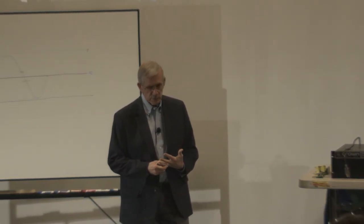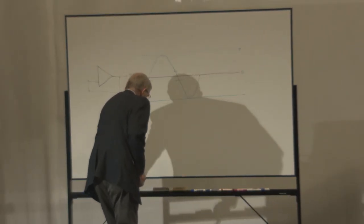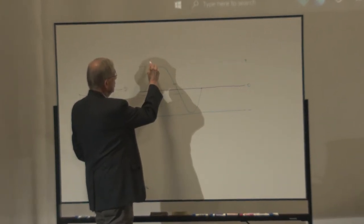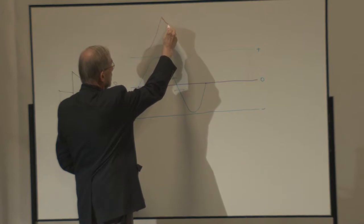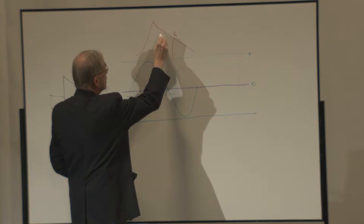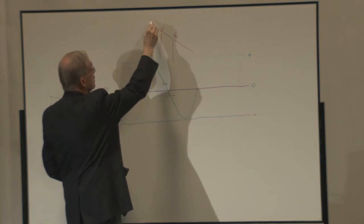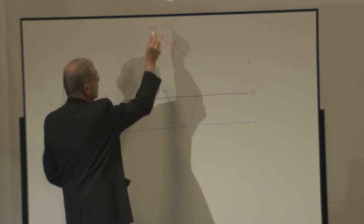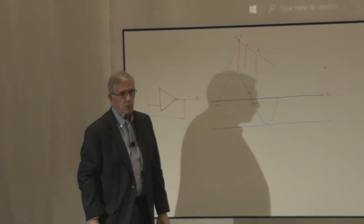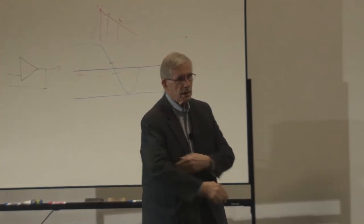And there are some specifications on amplifiers. These are like Crown's. If you look at the power, what it'll do, it goes up here and falls off like this, and this would be 8 ohms here, this would be 4 ohms here. And surprisingly enough, on those Crown amplifiers, their maximum power output was at 2.7 ohms. 2.7 ohms, that's 3 8-ohm loudspeakers in parallel.